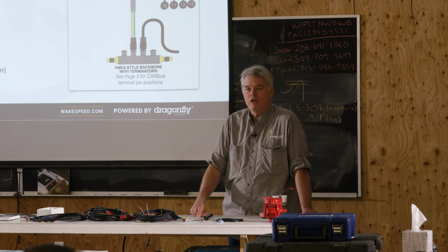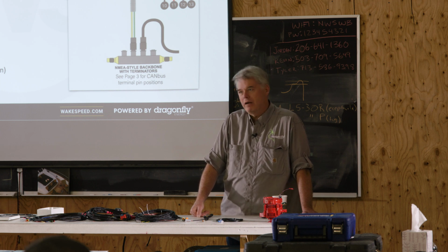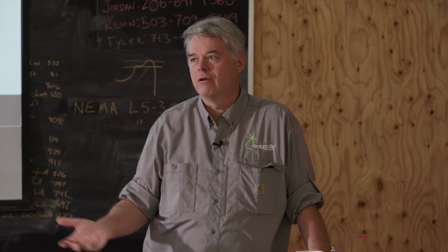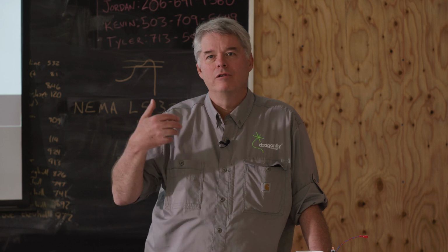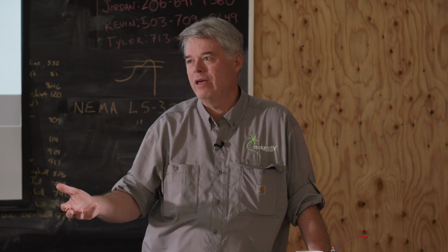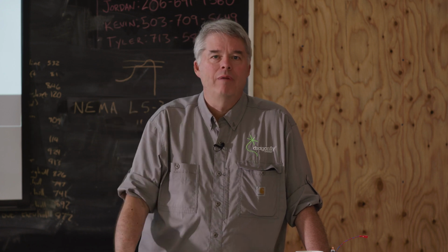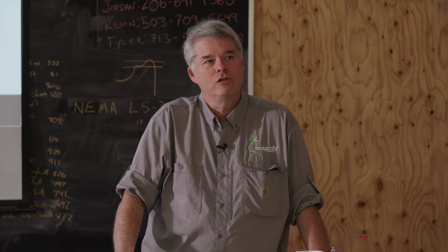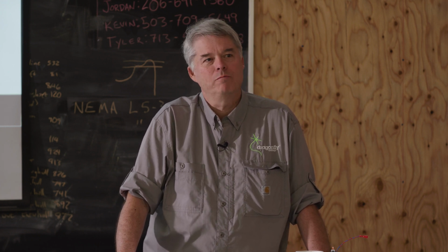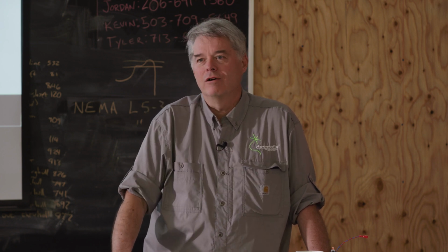I'm sure people who have done installs for a while know the classic customer complaint of, my battery charged and my tachometer stopped, what's wrong? We touched on this briefly earlier. It's because when the battery's charged, you're not exciting the alternator, so the alternator's not producing any power. It's not producing that AC waveform, and that's what the tachometer is driven off of. It goes back forever. Back in the lead acid days, my partner Rick's statement to customers was, well, do you have a microwave on board? They say yes. And he says, go make some tea, put a load on, and the alternator will come back online to support that load, and your tach works.